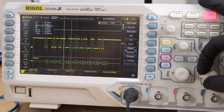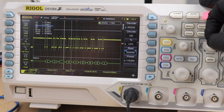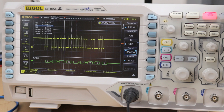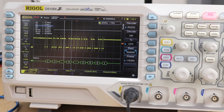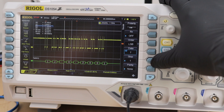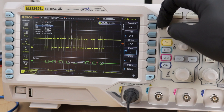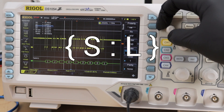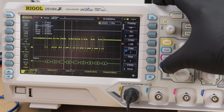If I now zoom out to see the whole packet, we can see what is being sent after moving the x-axis in a positive direction. It seems that they wrap all commands in curly brackets, followed by a colon and then something like x plus 200. If I acquire another packet while moving in a negative direction, I'll get x minus 200. So I assume the letter before the colon is some sort of command and all the stuff behind is the corresponding value. All three axes work the same way with x, y, and z plus/minus 200. For example, s colon l will ask the motion controller for a complete list of gcode files on the SD card. You'll find a complete list of all commands linked in the video description.